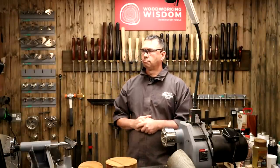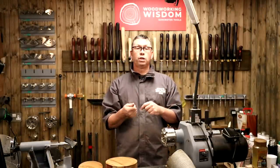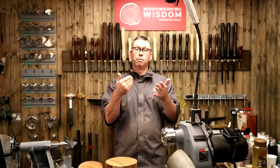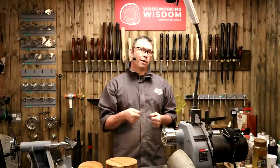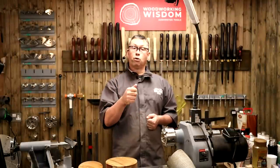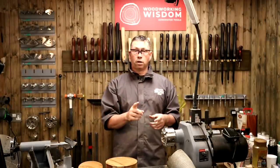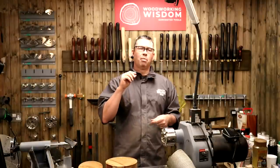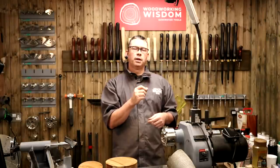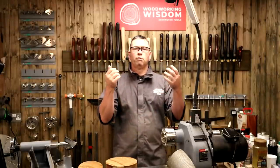Was that French polish put on bare wood? It was, yeah, there was no sanding sealer there whatsoever. So I'm using the French polish to be my sealer. And with French polish, like oils, you build them up. You put several coats on. So apply the French polish. Burnish is doing the job of the abrasive. So you're actually using shavings to take off the risen grain. Once you've done that once, generally that's enough in terms of taking off risen grain, because the grain is locked in. Then apply your light coats afterwards and burnish, buff. Keep going with it, and the finish slowly builds.